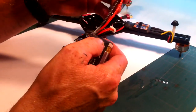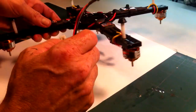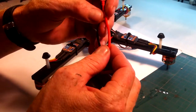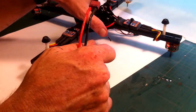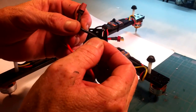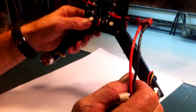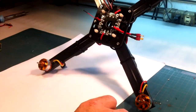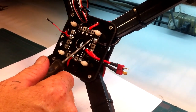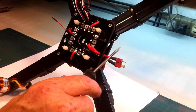If you look at a battery you're going to see a red and a black wire. What you want to do is connect each of the four ESCs' red wires to the red wire on the battery, and each black wire from the ESCs to the black wire on the battery. To do that there are two options: you can build a power harness or you can use a distribution board. In my case I'm using a distribution board for this quadcopter, which is easy to use because the pads are identified — positive, negative, positive, negative.